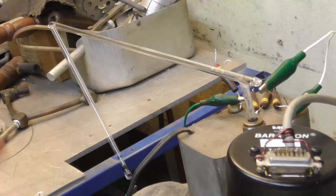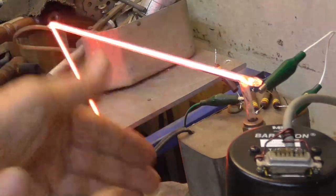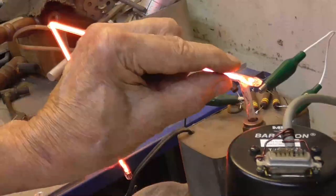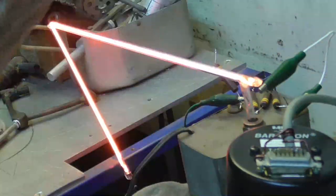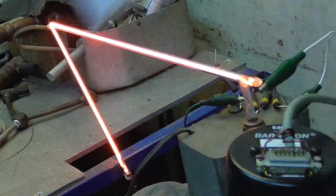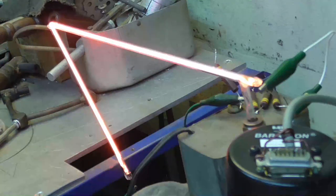It's got O-rings, it's got valve seats, and all of those leak. And that's why when we turn this on, we see a little bit of purple here, because the gas is slowly seeping back up, and the air which is leaking in seeps up in this end. So we see a little purple here, whereas down at the bottom, see, if you look here, we see kind of a purple color, whereas if we get here, it's pure orange. And as that air leaks in, it'll get down to that end of the tube, and it'll be purple too.